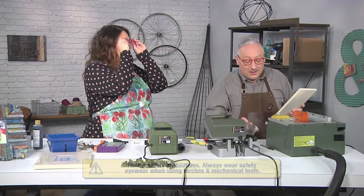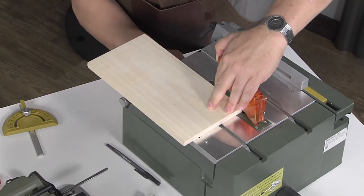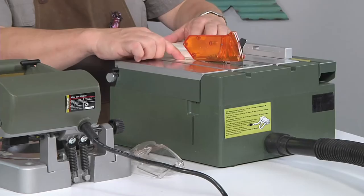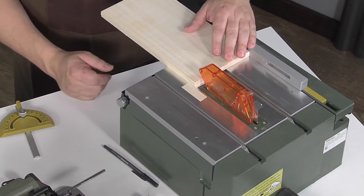Clever. I'm going to use safety goggles — putting on my goggles here. Since we're doing a rip cut, we don't use this, but we use the fence. The first thing I need to do is adjust the blade so that it's just thick enough to go through the wood. That's the safety guide, the orange thing on top. I have to lift it up so I can see the height of the blade. I used a piece of tape here just to mark — I know I want something three quarters of an inch or less. Clever, so you don't have to think about it every time.